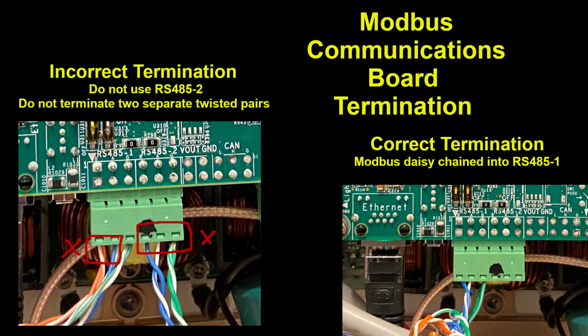do the commissioning. So after I took some photographs and sent them to SolarEdge support, they diagnosed that the wiring had to be changed. Contrary to their official manuals, all of the wiring for the battery needs to be terminated on the RS485-1 connection, not the RS485-2 connection.